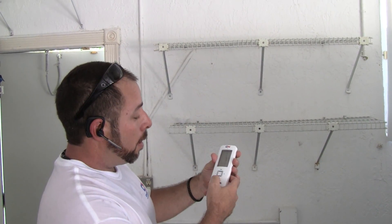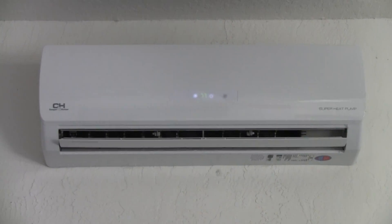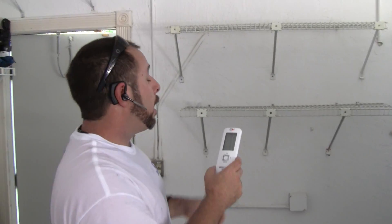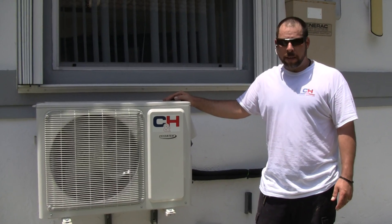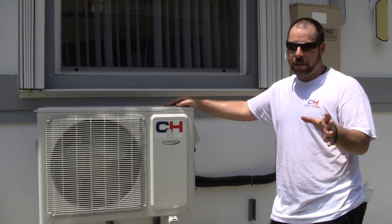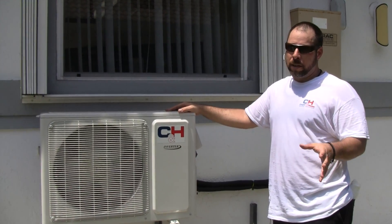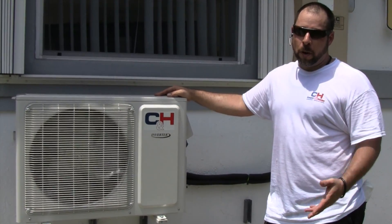Select the mode and turn it to Cool. The display will show a snowflake indicating cooling mode. You'll see the turning vane begin to open and air will start to flow — it may take about five minutes before the condenser picks on. Then just set your temperature. The install is fairly easy with basic tools, but always make sure you have a licensed HVAC technician — preferably someone with experience in mini split systems — to help out. Thank you for watching, hope you enjoyed the video and learned something.